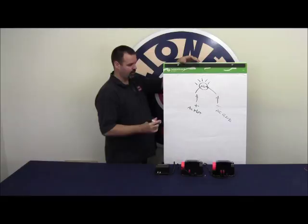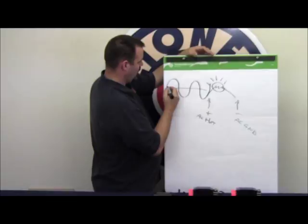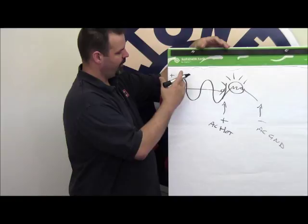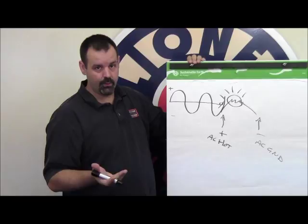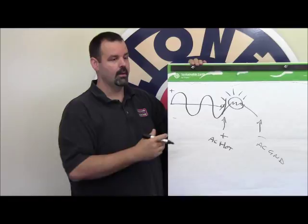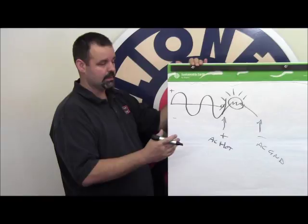Because we're working with AC in a three-rail application, we're dealing with a sine wave where the straight line represents zero. Above the zero crossing is plus, below is minus — this is alternating current. In the United States this alternates back and forth 60 times a second, in Europe and other countries 50 times a second. That's the difference between 50 Hertz versus 60 Hertz. Here in the States we have 60 Hertz AC power.